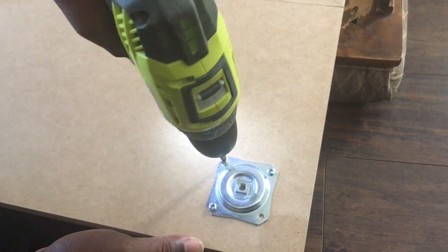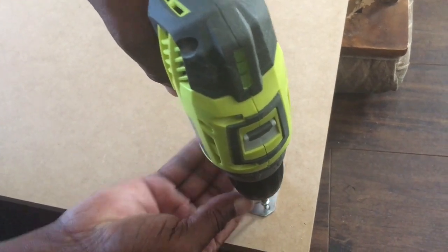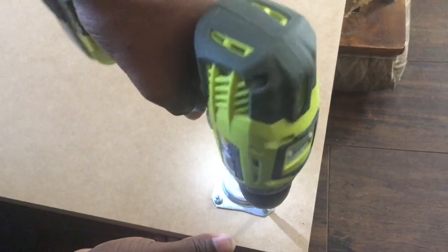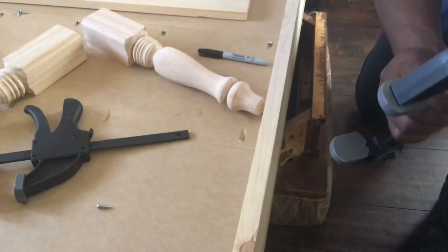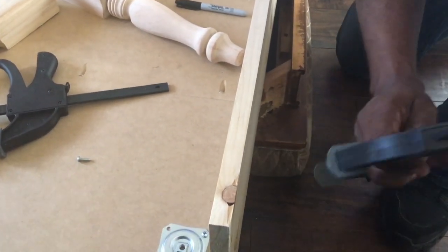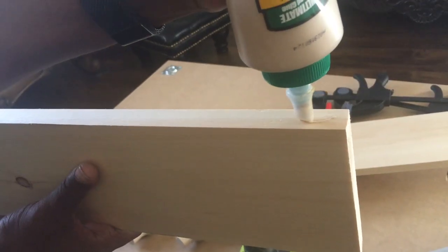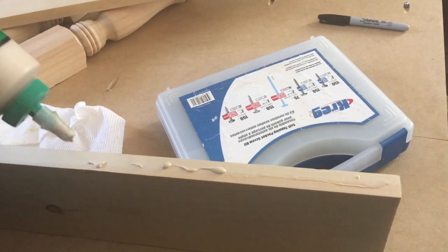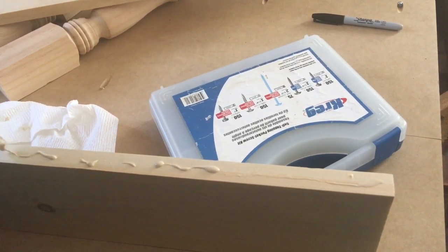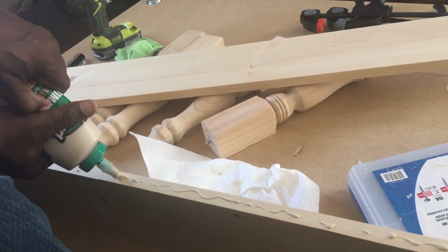Here's the last leg bracket being installed. After this, we'll be installing the sides — or the skirting — of the ottoman. These are the 1x6s that my husband has already cut to size. We added a little glue to them and attached them. He was attempting to secure it and we found that his clamp wasn't quite big enough, but that was okay because we had already planned to also use the Kreg on that, so it would be pretty secure — cragged and glued.